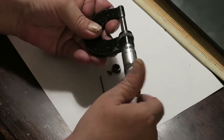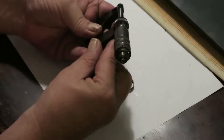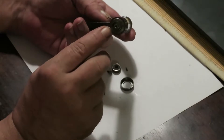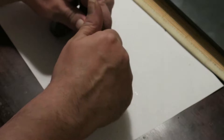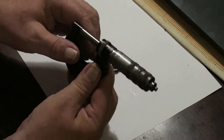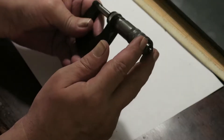There is one thing I need to do with this one. When you put it together, it doesn't go entirely to zero — it's showing one hundredth of a millimeter difference. You adjust that here at the back, and you need a special tool to do that. I probably need to make one. Usually you have slots where you use a wrench to rotate this, but this one is a little bit different.